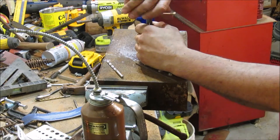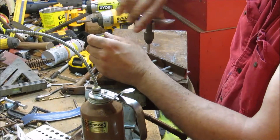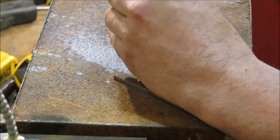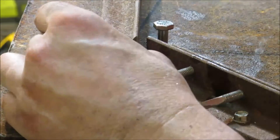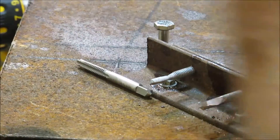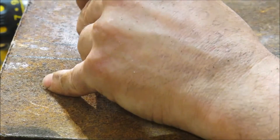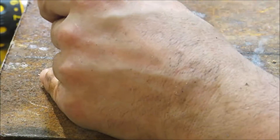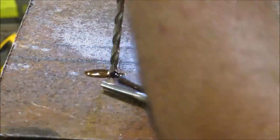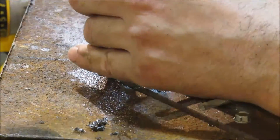You want to go nice and slow. Once you get it where it starts hitting resistance, you want to back it off, then go forward again and back it off. It's kind of a feeling — if it seems like it's tight, you want to stop. This is kind of the arm; this is almost like a sheet metal break for pins. Once again I'm a little crooked, so as you can see I was a little angulated on the punch, and here we go tapping again.